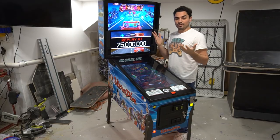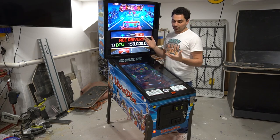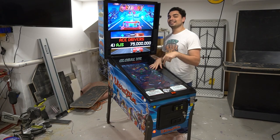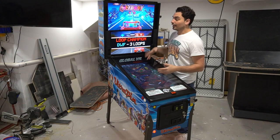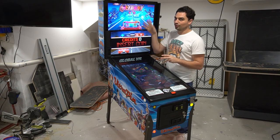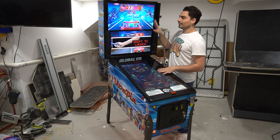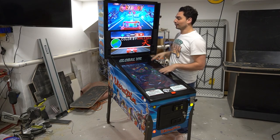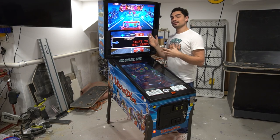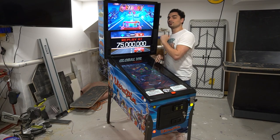So before we continue, I should really tell you the specs on this thing. This is a 3-screen setup. First screen is your playfield screen. This is running a 32-inch Samsung 60Hz 1080p display. As far as the back glass, we do have a Westinghouse regular TV, kind of old school, dated. This is a 26-inch running 1080p, 16:9 aspect ratio. And the DMD, we put in a 24-inch Acer 1080p, same thing, 16:9 display. So there are three screens.